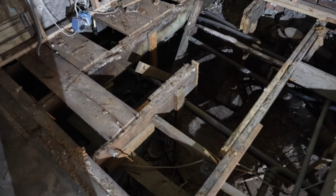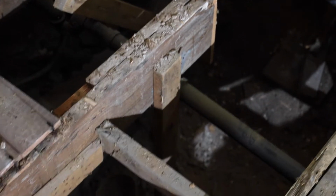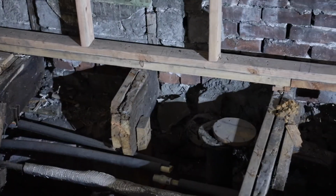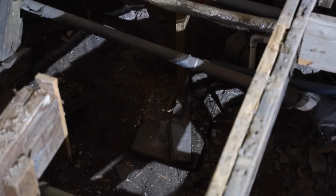Obviously, again, you can kind of see this one's a 2x4 nailed into the side. It's not underneath. It goes all the way down and it sits on the dirt down there. So it looks like there's a board underneath it trying to hold it up, but it's not underneath it, so it just has all the nails in shear. And then on this side, similar story. You can see the top of the 2x4 nailed into the side right there, and the bottom's sitting right there.